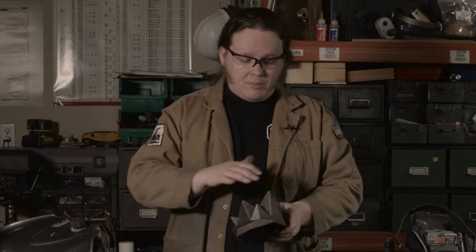So, everything's ready to go. Now we need to weld it together. The question is, how do you do that? I mean, look at this thing. There are no right angles on it. I can't tell you what the angle between those two things are, but it's some weird random number. And again, precision is really important here. If we don't get the relative alignment from piece to piece correct, by the time we get to the other side, there'll be huge gaps.